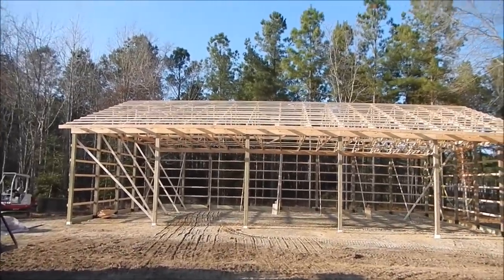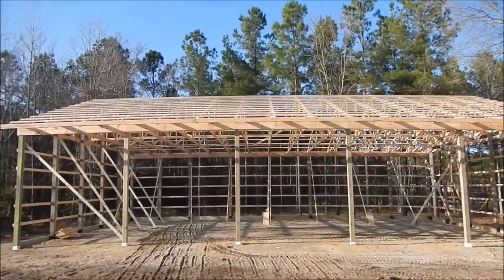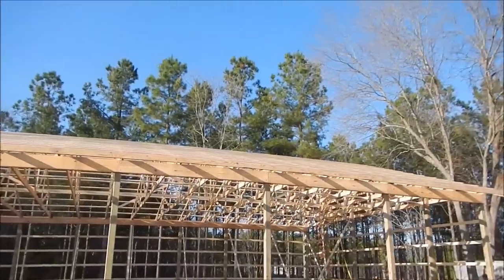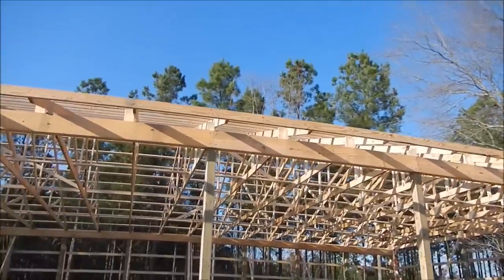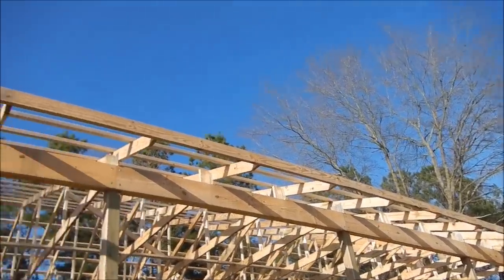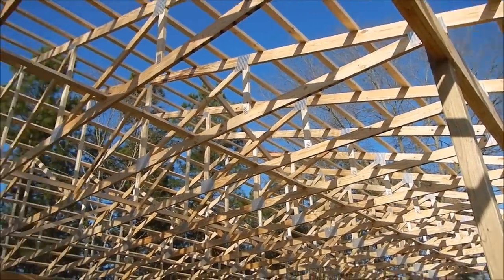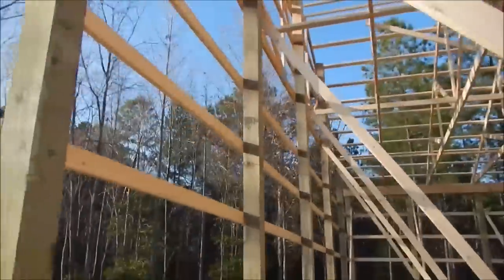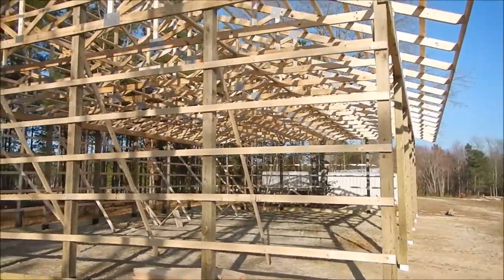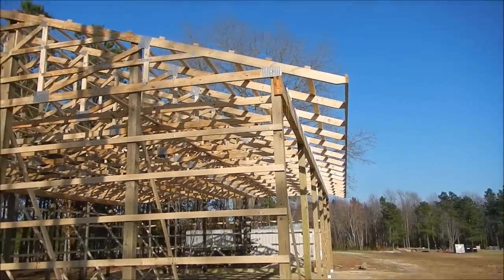Here we are at the end of day three. Those three guys had a very productive three days. They got all the rafters put up. Yesterday they put the boards up for the walls and the top for the trusses to sit on — they doubled up three two-by-twelves, notched them, and bolted them in. They got the gable end trusses set, and today they finished putting all the trusses up and all the slats for the tin to screw to. Metals are ordered — it won't come in till Tuesday, so it'll be Wednesday before they can come back and wrap it with metal.